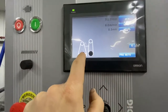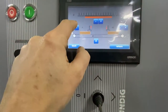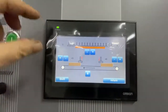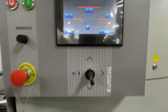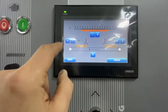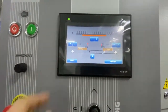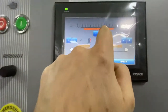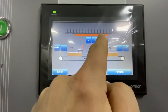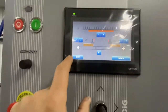Let me show you the pad here — this is something very interesting. These are all individual sectional pads which move up and down according to the sensors when it's measured inside the machine. We can actually set these to time in and time out — so depending on if you're finding that it's perhaps doing too much on one end or not enough on the other, this is obviously the back end of the board, front end of the board, so you can actually alter that as well, which is quite nice. You can also on the width — basically the default was zero, but if you need to add a bit extra on or take a bit off, this just gives you a bit of control and programming feature of the sectional pad.